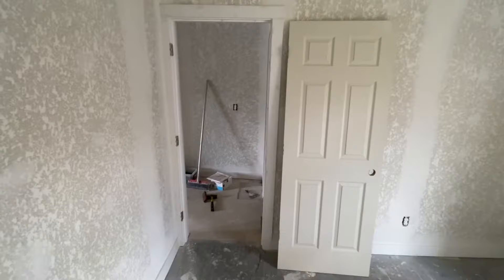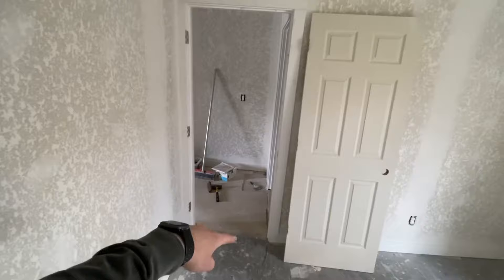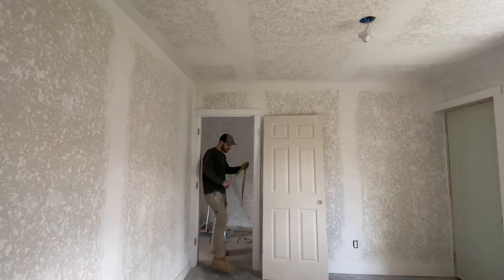When you're working against an unfinished floor like this one, you're going to want to do two inches off the unfinished floor. So we're essentially going to measure the door jamb and then subtract two and an eighth inches from that — that's how much we're going to cut off the door itself. From the unfinished floor to the top of the door jamb, it is 80 and three eighths. So I'm going to subtract two and an eighth from it, and that gives me 78 and one quarter.